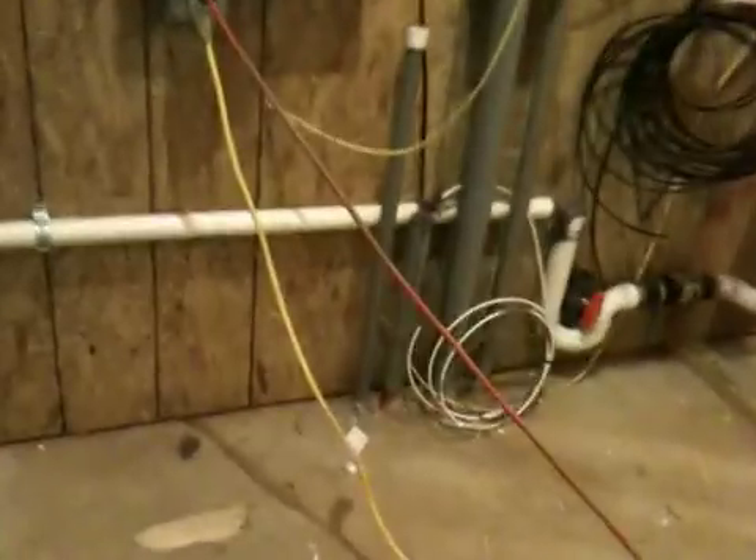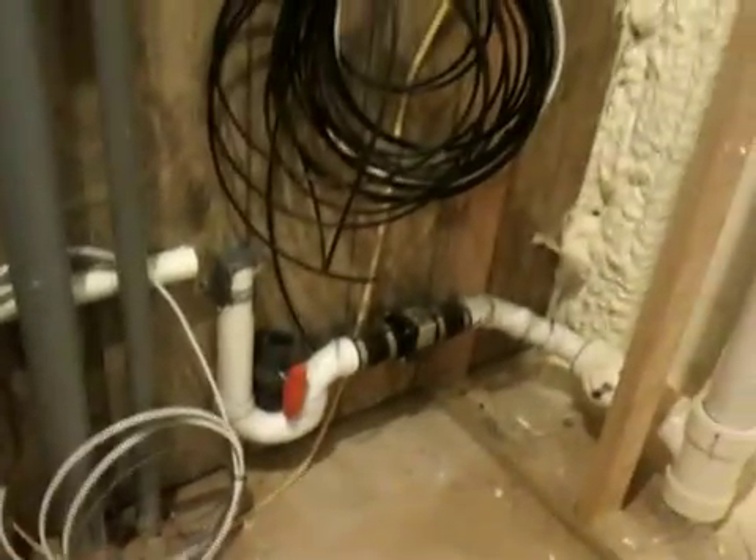From the mechanical room up to the bays on the first floor, below the dining room where we are now in the study — since we can't get behind this mechanical wall, if we ever have an air problem here, I had them fill in this whole cavity on this side. Then we could spray cellulose in behind here all around, and caulk or foam on the bottom. Should do a pretty good job of isolating that.